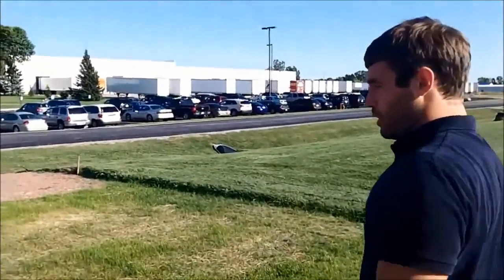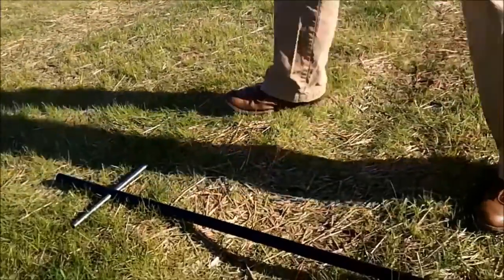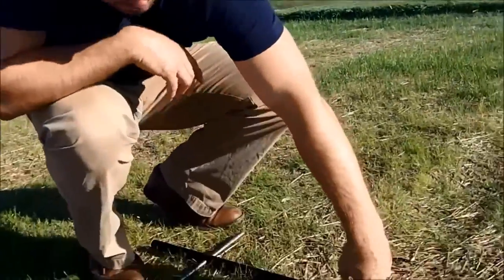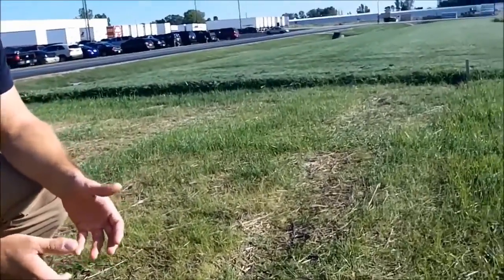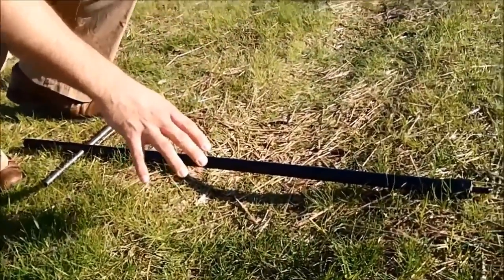In contrast, with only two driving cycles on the rolled ring product, you can see very large ruts have already formed — easily two to two and a half inches of deformation. That's because the rolled ring product offers no structural benefit to the system. It's just sand. It tries to contain the sand but under a large load, the sand gets pushed out of the way, and it can't transfer load to the sub-base layer, resulting in this large rutting effect.